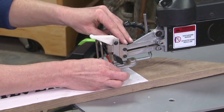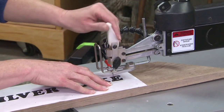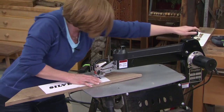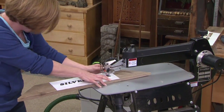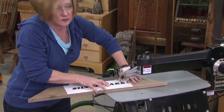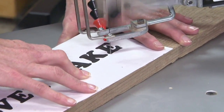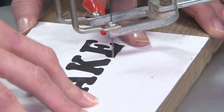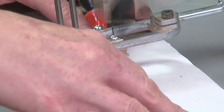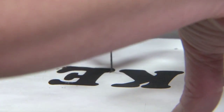I pierced the blade through the pilot hole, now it's time to get this all positioned correctly. I want to make sure I get the blade all the way back in the jaws of this chuck and tighten it down. Then I've got my tensioning lever — it's still a little loose so I'm going to turn the tensioning knob. I've got the blower in place, so now it's time to turn it on and make some cuts. I want to keep my hands firmly on the table and just let the scroll saw blade do the work for me.